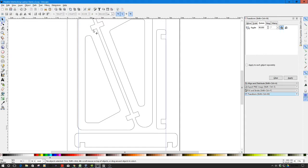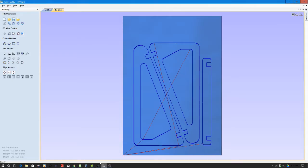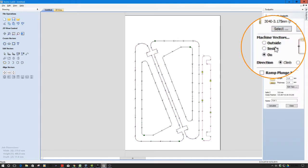I created this model, but in Cut2D I had to change it up a little bit because it's too big to print on the 3040 lengthwise. I thought I could get away with it but I couldn't, so I had to break it up into two pieces. Looking at the geometries in Cut2D, I printed the front piece as a second piece. I want to talk a little about tool strategy - you can cut on the outside of the line, the inside of the line, or on the line, and you can utilize this to balance your opening size.